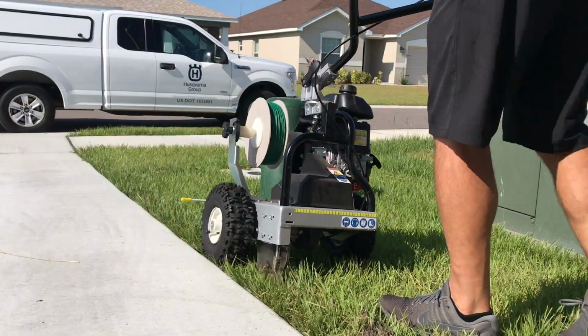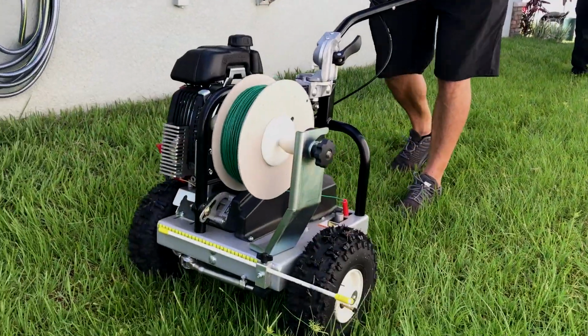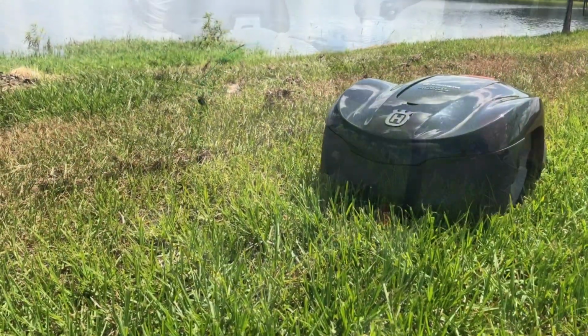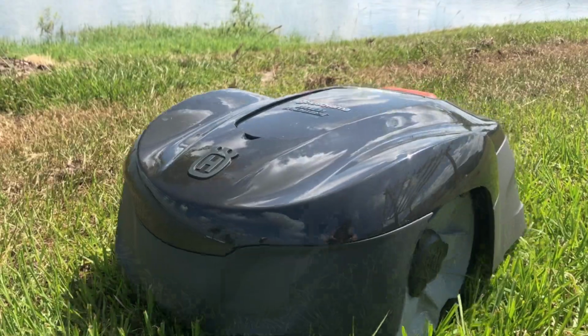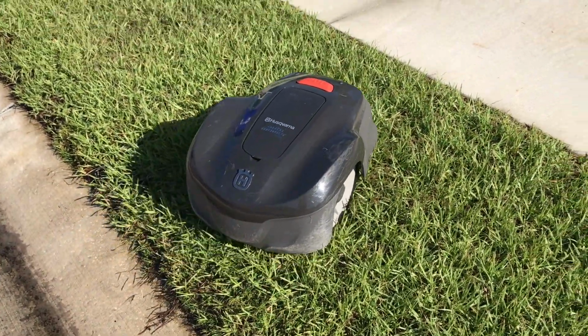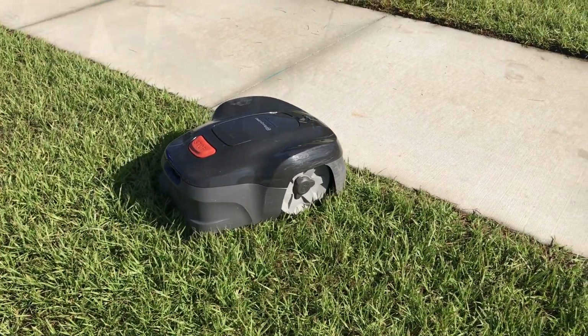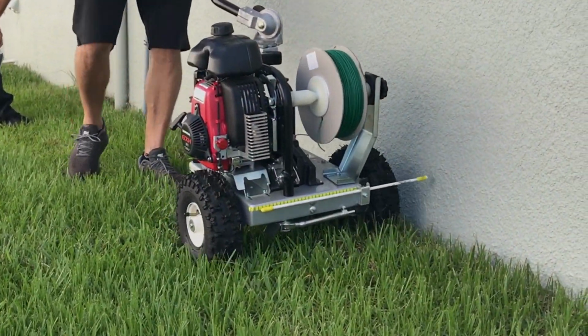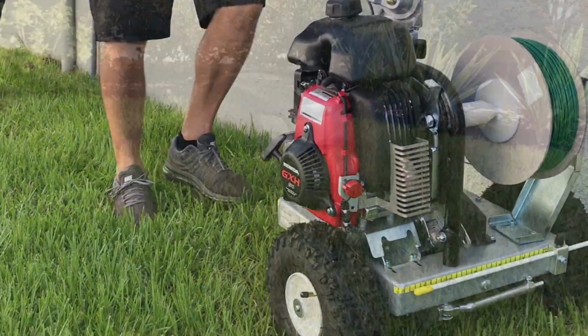The 115H Automower knows its bounds through the use of a boundary wire and a guide wire that literally guides the mower back to base as needed. It helps define zones and also get the mower through narrow corridors. This model uses a single guide wire, and that creates some limitations, which is why this model is best for simpler yards. Ideally, you install the guide wire across the longest possible area. For our install, that was the side of the house.